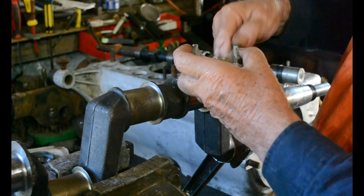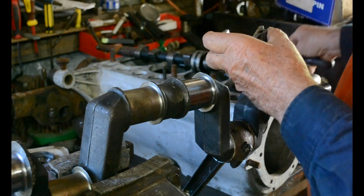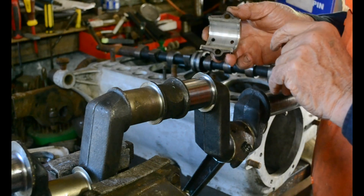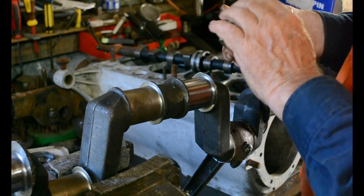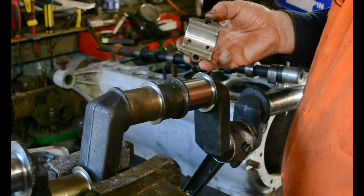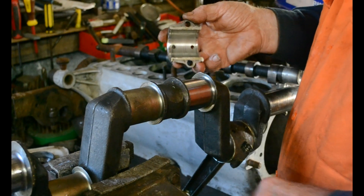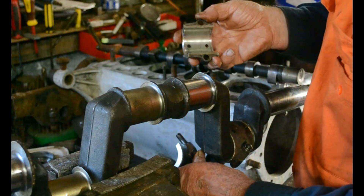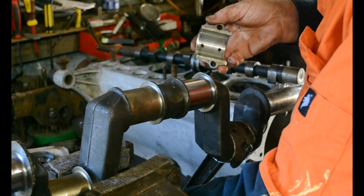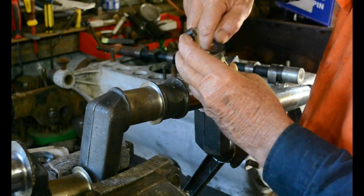If your bearing's tight and you try and scrape it in, you'll be there for hours. And of course if your bearing is tight, you can just add a shim in there if you like. But I've turned this to .05 of a millimetre clearance and it seems to be good enough. Now if you turn it too large, then you can take a shim out, and you can close the gap up using those graduated shims that you can peel off, peel apart, that I showed you before.